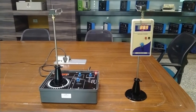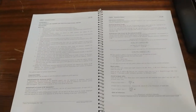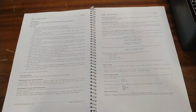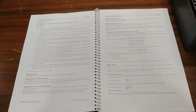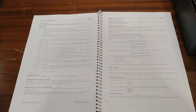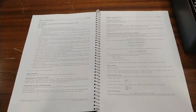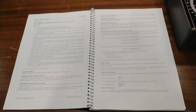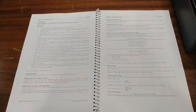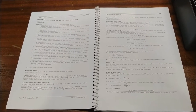This is how the antenna works. This is the basic installation type in which all different types of antennas will work — we install the transmitting and receiving end and just change the antennas. For optimum radiation, the following actions can be taken: adjustment of antenna match if necessary, adjustment of RF generator level for low-gain antennas (set the RF level potentiometer at maximum position), and the DPM directional coupler reading can be set to 50 µA at different ranges for different antennas.